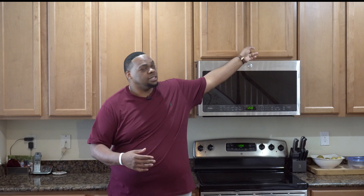Some people like to flip it the other way to light up the countertops more — we're going to bounce our light off the wall. Here's a pro tip: lay all your lights out because you want to map out your wiring back to your power source. Our power source is actually above the microwave here in the cabinets. We have two plugs — one is used by the microwave and we have a free plug. Since we have a smart home, we're going to use an Amazon smart plug so we can tell Alexa to turn on the cabinet lights or do it from our phone.